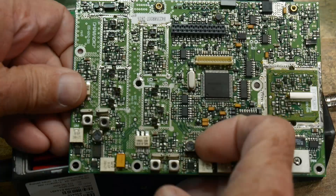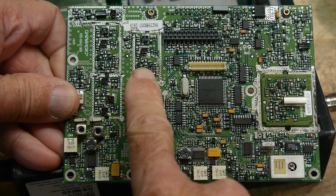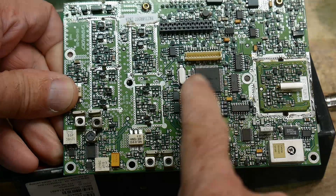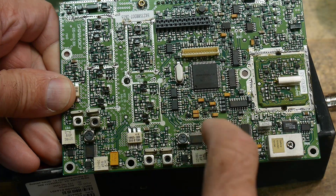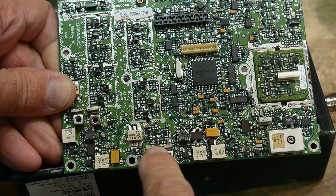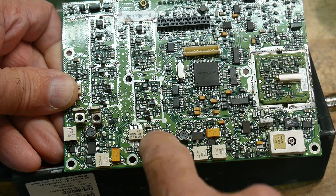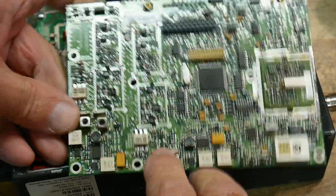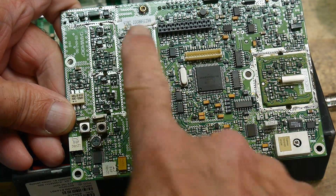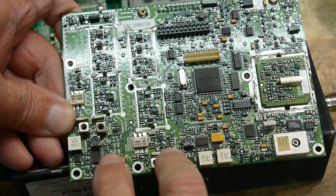One antenna goes through this section and one antenna goes through this section. So this antenna goes down this way, goes into a preselector and a low noise amplifier, and then it goes into a LO with a mixer, and then it goes into the IF stage which is a crystal filter — and these are tuning for the crystal filter. So it's a four-pole crystal filter. The other side, this antenna goes through an LC, then goes through the exact same circuitry, and they use it as a diversity antenna.